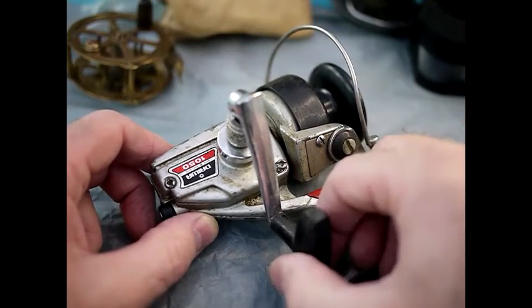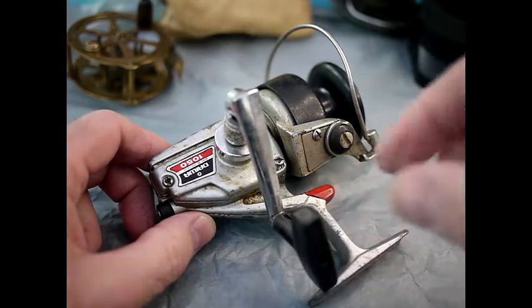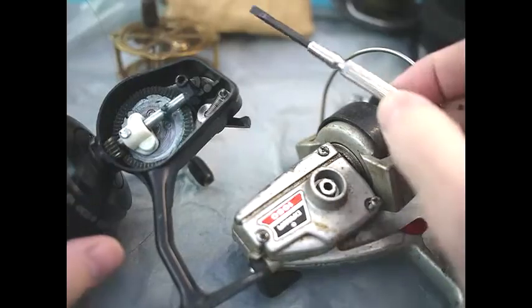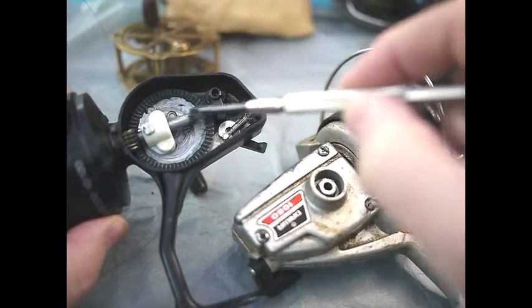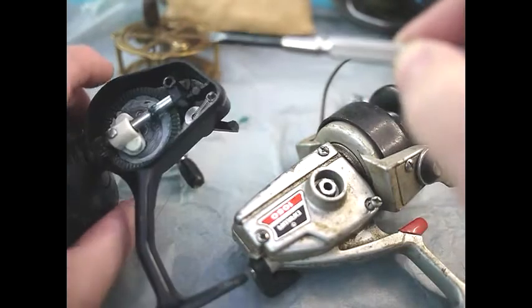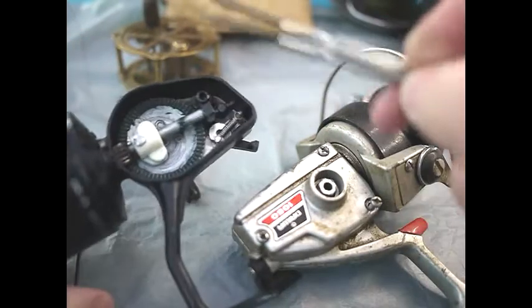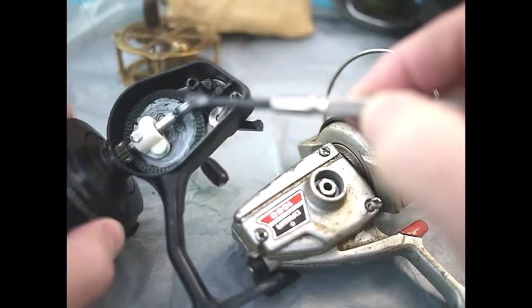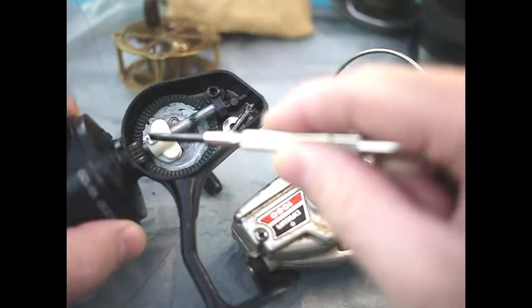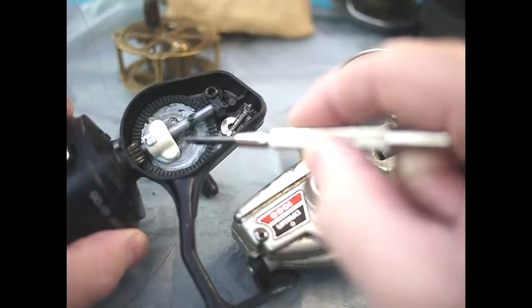Just the slight difference in approach between the Japanese and the old Mitchell reels. The first thing we see is the old Mitchell reel here — it has a main cog and a cam rider that slides up and down. The handle section tends to be connected directly to the main cog. In some cases on Mitchell reels you've got an ambidextrous fit, but in most cases this particular reel is fixed. This is just held on with a pin — it looks like a rivet but it's actually a pin, it just lifts out. And you've got a cam here which rides on a little cam rider on the main cog and spins around.